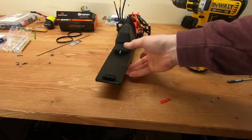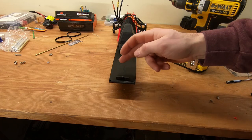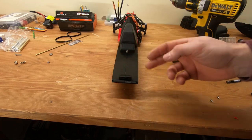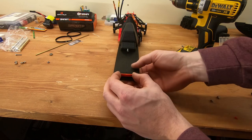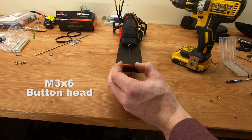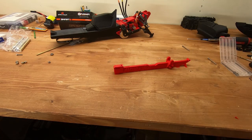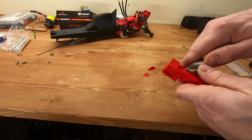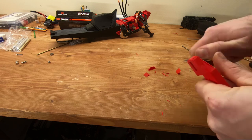In my snowmobile I'm not installing tail lights, but if you want LEDs on the back, use two 3mm LED bulbs and find a way to route the wires. I forgot to put a channel for where the wires would go, so if you don't want LEDs just put the back plate in place with two M3x6 button head screws. This kit is printed with support material that you have to take off — I tried printing many times without support material but this always gave the best result, so use an X-Acto knife or utility cutter to remove it.